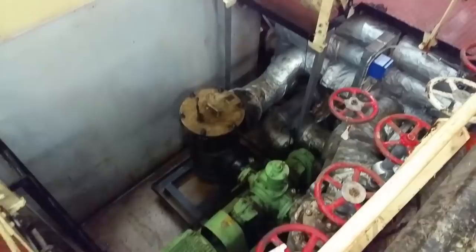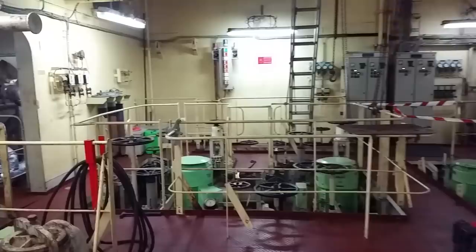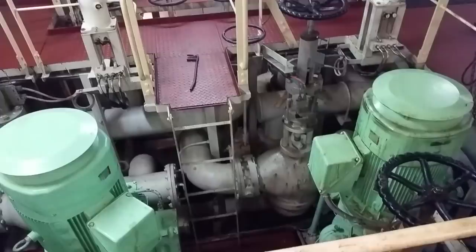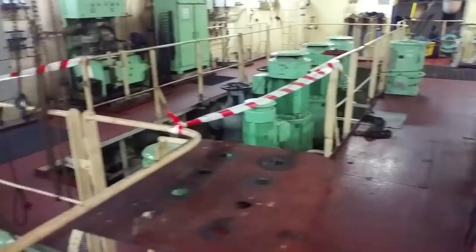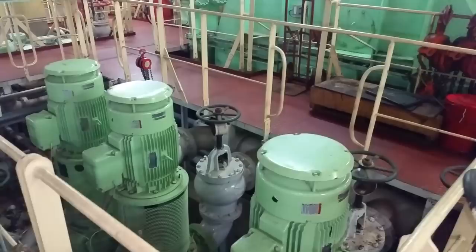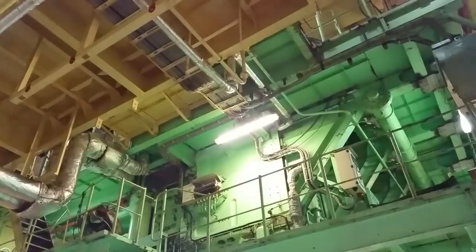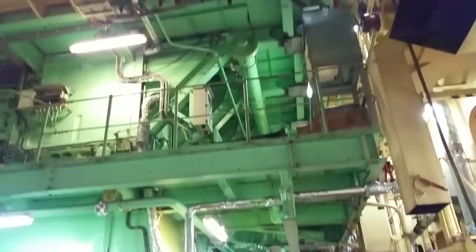This is the cargo hold bilge stripping pump, which isn't here right now — it's up in the workshop for maintenance. These are fire and general service pumps — there are two of those. We're on the forward port side of the engine room now. These are reefer cooling pumps — salt water reefer cooling pumps. We don't need them on this run, but if you're in a hot part of the world they provide cooling water to your reefer containers. Separate lines can be plugged into containers in the cargo holds to circulate water — you might need that going to the Mediterranean or Dubai, but not on this run to Europe.